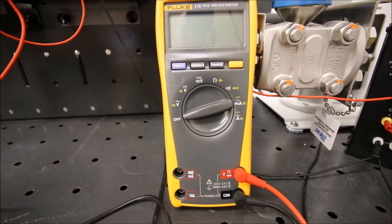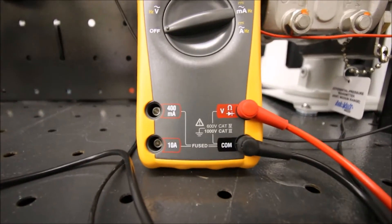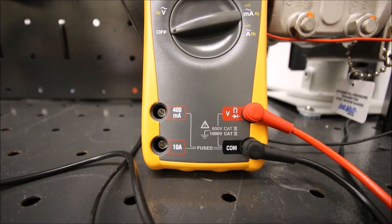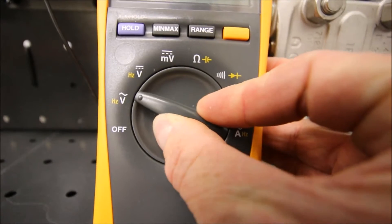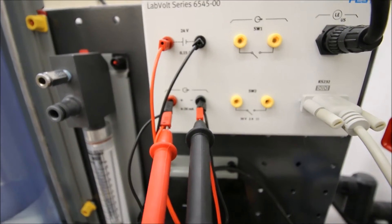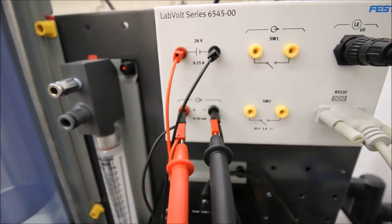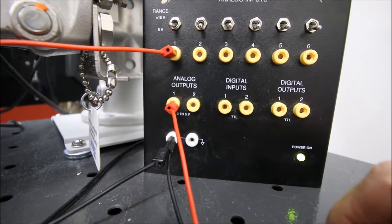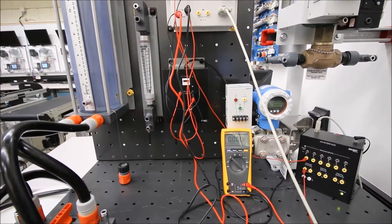Next step — we're going to connect the meter in so we can actually look at that voltage and make sure it's the same as what we're going to see on the computer screen. From the previous lab where we looked at current, I took that meter lead out of the 400 milliamp terminal and I brought it back to the voltage terminal. We're going to be in parallel with that resistor. We're going to see that DC voltage, so we're going to change this to reference DC voltage. Then we're going to take our meter leads and go in parallel with our 250 ohm resistor, so my meter leads are now referencing the same voltage as across my resistor.